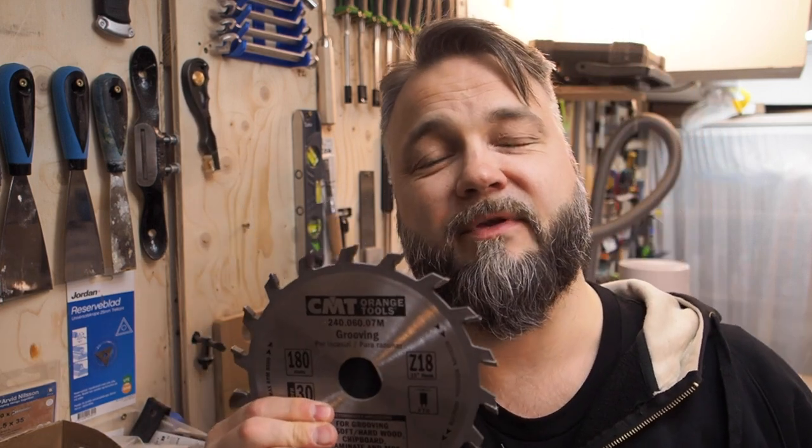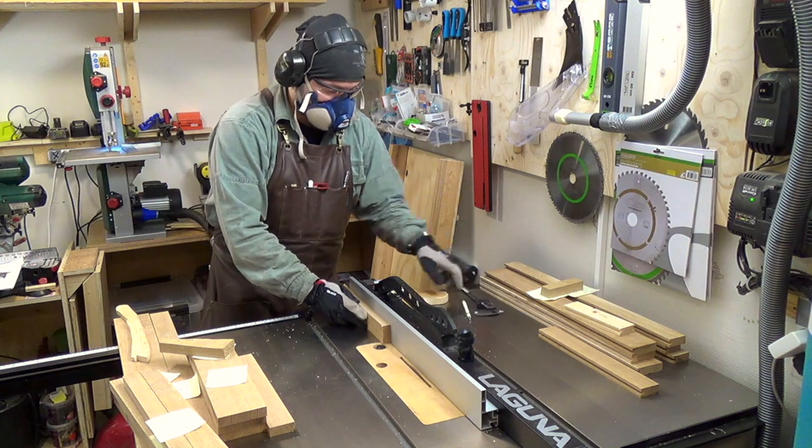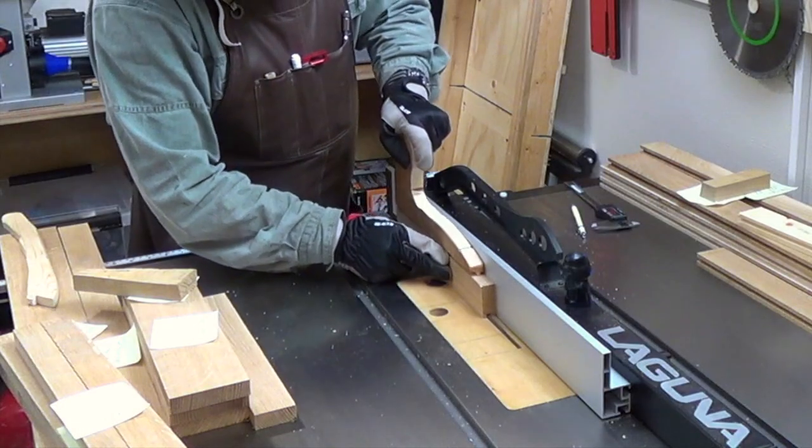This is my CMT grooving blade. It's a 6mm wide flat top blade, and all the joinery in this project is based around this blade. I'll leave a link to it in the description below. Many of the parts needed a 6mm groove to accept a floating panel, shaker inspired.